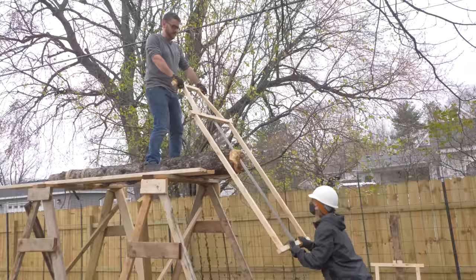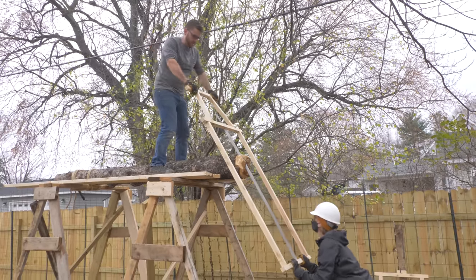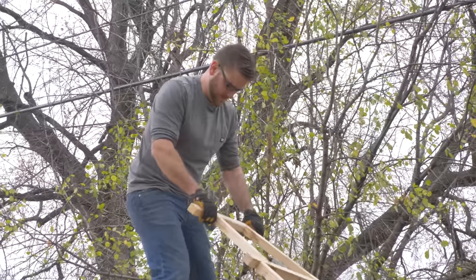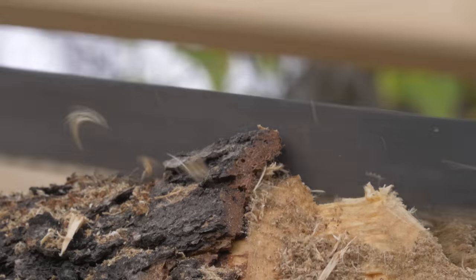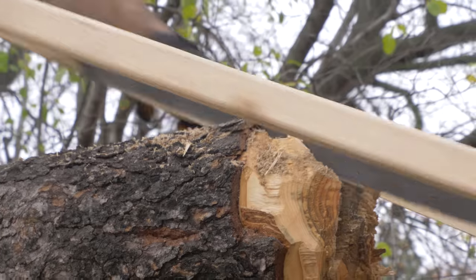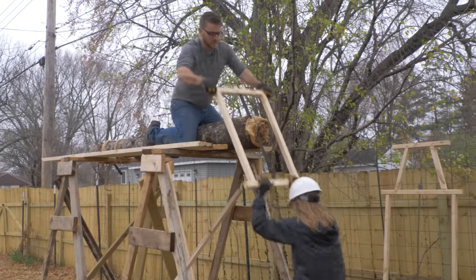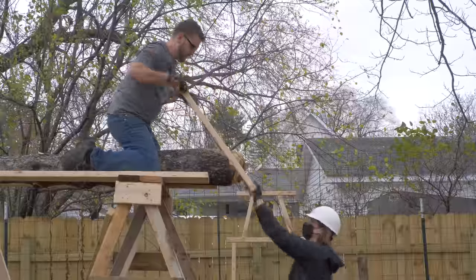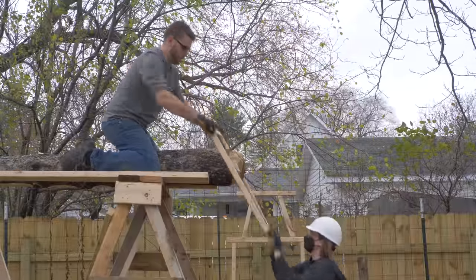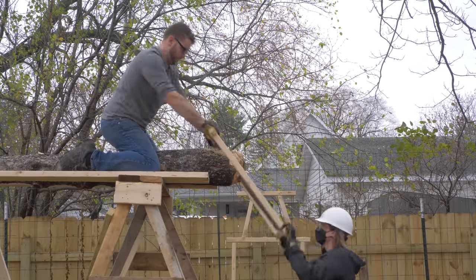We braced and tied things off at the end, adding little platforms for more stability — it's a touch wobbly, which isn't great when sawing. The log was also left in the rain so it's nice and wet, which makes it probably even harder to saw. The smaller saw seems to have better luck since it has larger teeth and creates more kerfing, making a bigger channel so the saw blade doesn't bind — that's the main challenge with the bigger one. It's pretty slow going and the head of the log is rotten, so it might get even harder as we go.